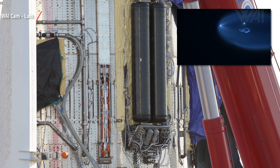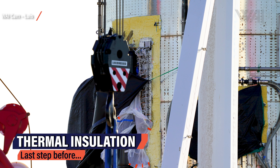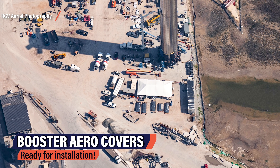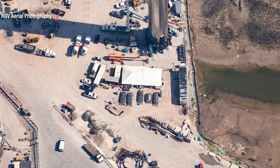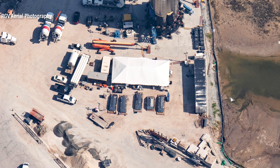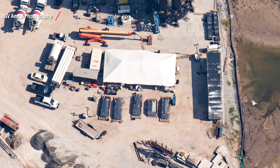Engine relight of the center engines and maybe even pressure for the RCS — the small reaction control thrusters on the outside of the booster. In combination with the engine gimbal system, they give the Super Heavy booster the ability to change direction in flight. You'll notice a yellowish blanket — that's thermal insulation, recently put around every single one of these systems. Aerial pictures show that aerodynamic covers lined up at the launch site will be installed on the booster next, changing its visuals quite a bit.